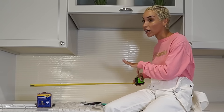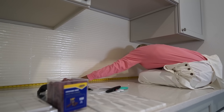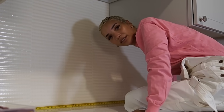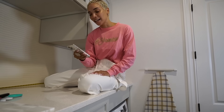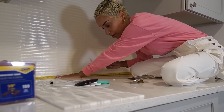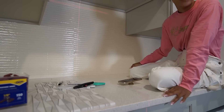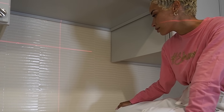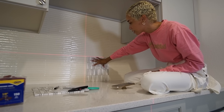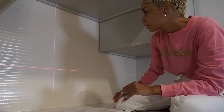So to find the midpoint: 85 and one quarter divided by two is 42.625 — so we're marking the center. We line up the laser level with that, and then once we get the laser level in the right spot, nobody touch it. Our first two tiles go right there. So now you peel your sections. It looks like they lined up little bees like soldiers and told them to poop out little squirts of honey. I'm scared — once you place, you can't erase. Correct, so don't mess it up.